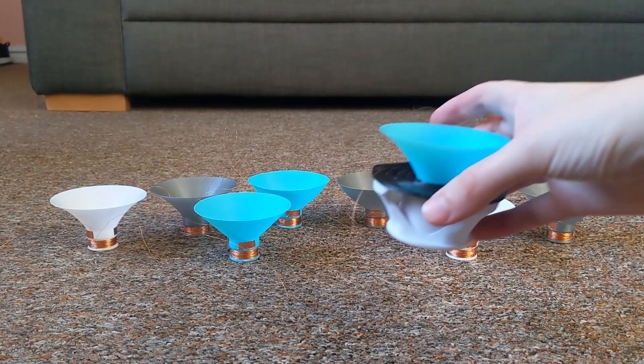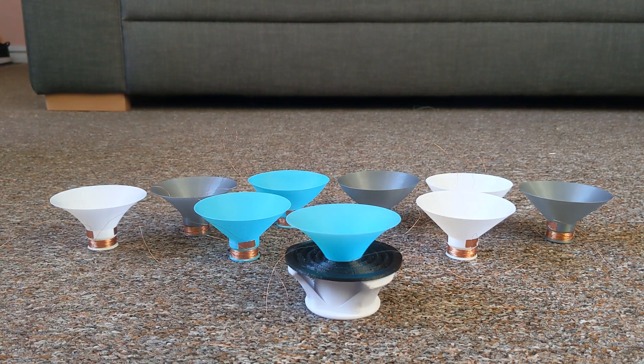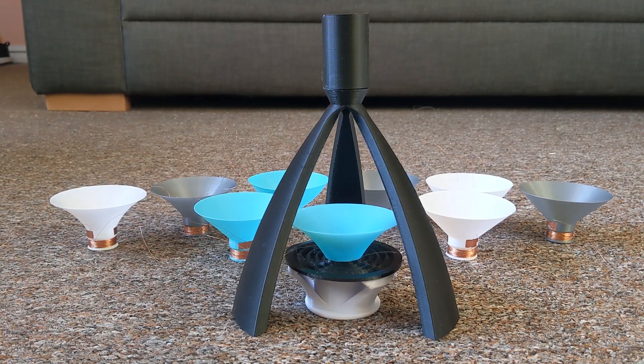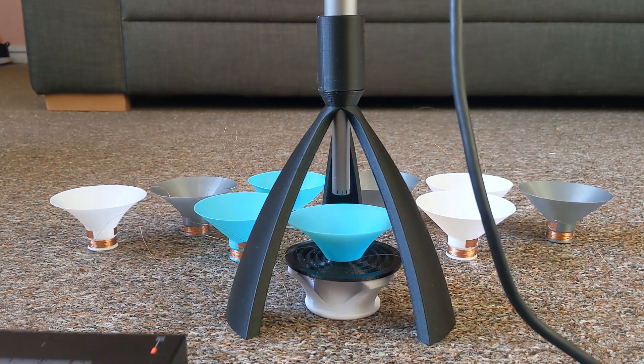The Cone Test Platform was created to help with my own 3D printing speaker driver projects, but also to capture information that will hopefully be helpful when it comes to FDM 3D printing. By using sound, we will be looking at how stiff a material is across the Z-axis, how it deals with absorbing shocks, and what stage it absorbs high frequencies.